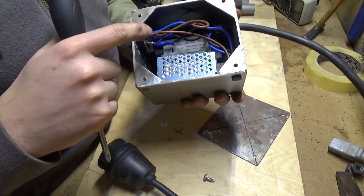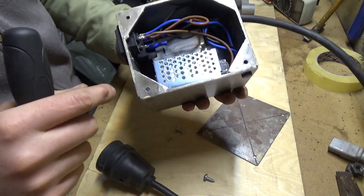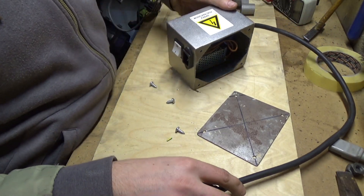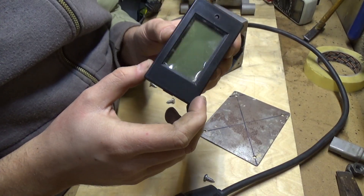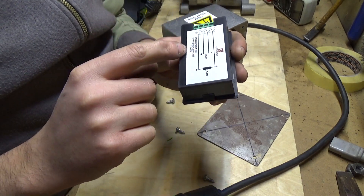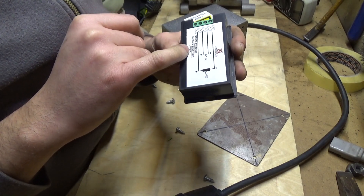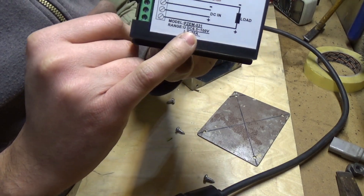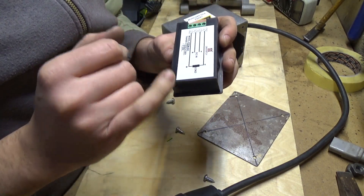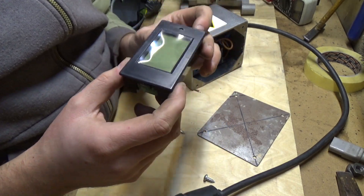I used an ordinary cable and plug to connect devices to this motor speed controller. These units are both on eBay and I will put links in the description below so you can check that out. This is how the display looks out of the enclosure - this one is for DC current and it is rated for 6.5 volts to 100 volts and up to 20 amps. So I will use this voltmeter in another project.